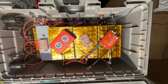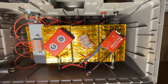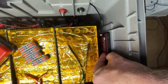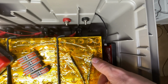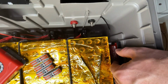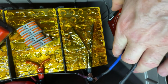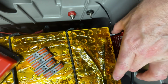The next thing we need to decide is exactly where we're going to put all of these devices so we can lay it out. I was thinking of putting the BMS over on this side, down below the battery. This way the temperature thermistor or temperature probe can actually come up on the negative wire, because this is usually the hottest part of the battery. We can then connect to the battery and still have this the top negative, because the blue line connects to the negative for the battery, and this will actually go out to your devices, and then you need room to connect your BMS line.